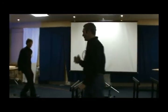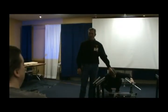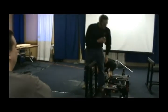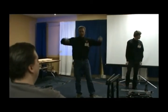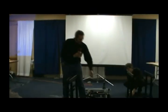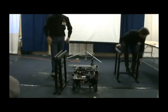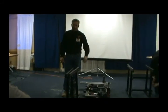Well, you know what? That's a question that so many people have asked me. This machine is every bit as accurate as the best tools in your workshop. And it really is going to be as accurate as you want to make it. It has calibration adjustments for your square, even calibration adjustments for the roller guides. These roller guides go up and down with one finger. I mean, it's the best roller system I've ever used. There's adjustments for these. These come from our facility, pre-squared and pre-adjusted. But the instruction manual tells you, if you need to, a year or two down the road, how to check for square and how to calibrate.